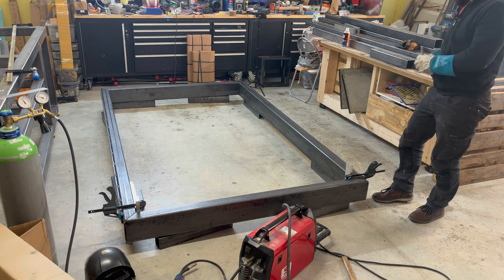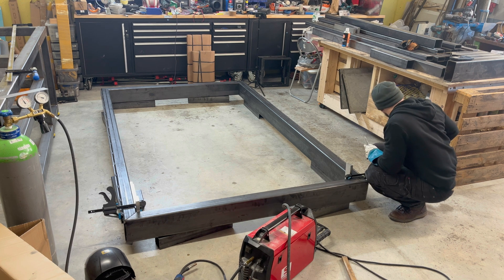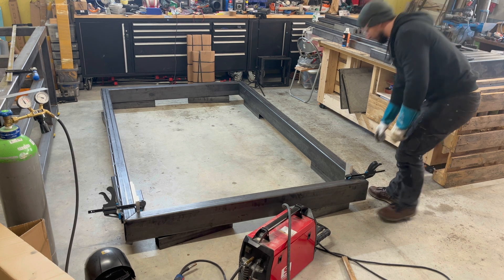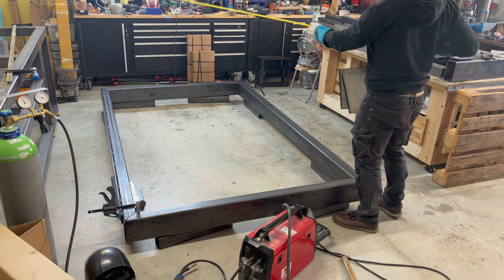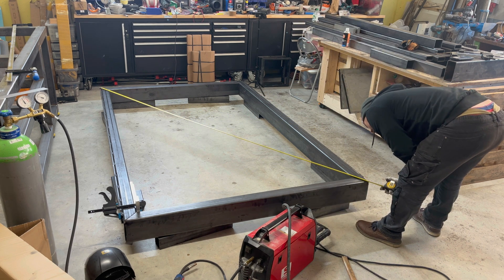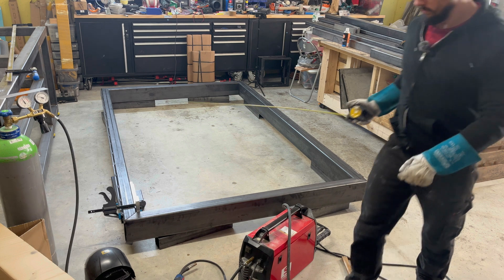When you put linear rails on and then put your gantry on, everything must be perfect. If there's any inward or outward force on the 2.5 meter bars where the linear rails go in, your machine will bind and it will not move at all. So you have to make sure everything is square — always tack weld first, even the internal supports, before you start welding everything out. I'm checking diagonals to make sure the sides match up, and it wound up being one millimeter out of tolerance, which is perfect.